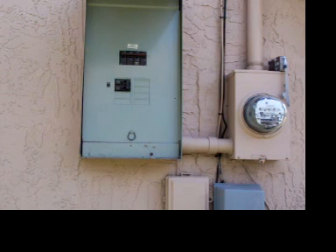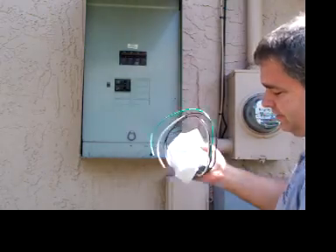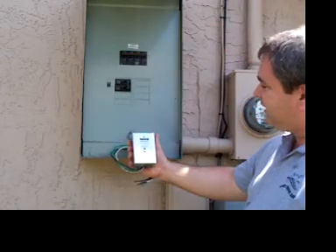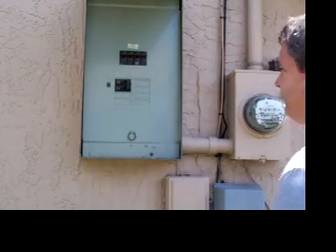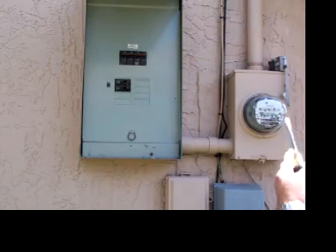In my little series of things I'm doing to the house, I'm going to add an entire whole house surge system. The whole house surge protector is basically a device I'm putting into the main input power panel. It's an EDCO unit, a two-phase unit, and it'll basically protect the whole house. Florida Power and Light kind of forgot to give me one — they gave me their little rinky-dink job that's up on the power pole.